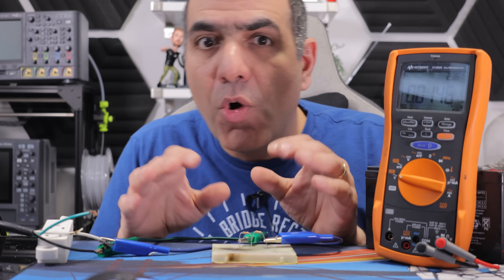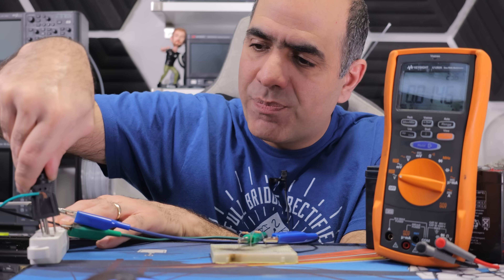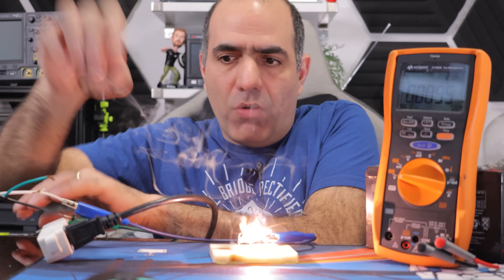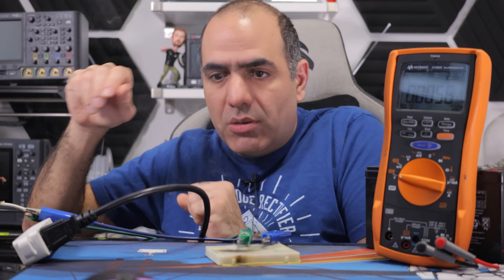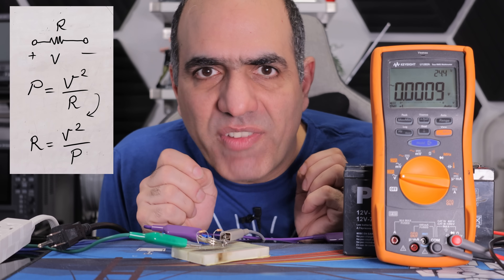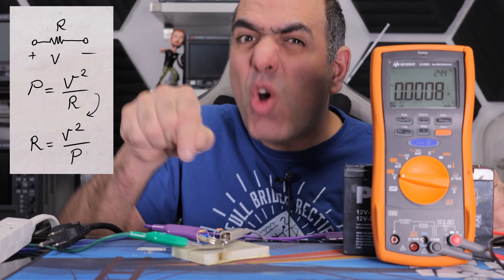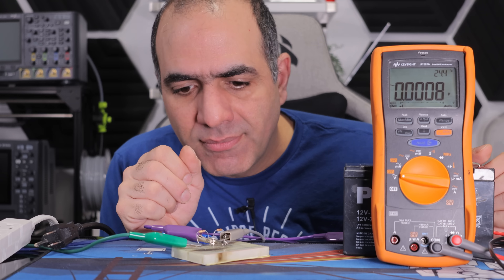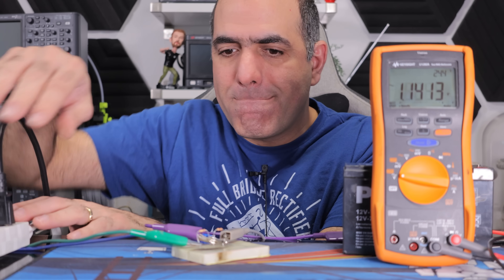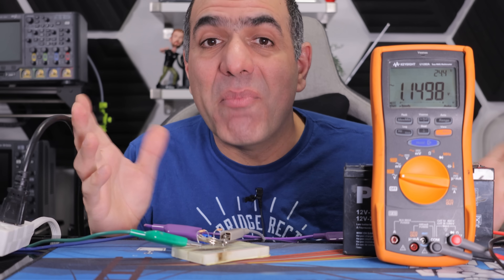Here, I'm lowering the 120 volt AC down to 1.2 volt AC. You must pick resistor values that, for a given voltage, only consume power below their power rating, or they'll burn. These 100k and 1k resistors should be good, though. There you go. Yeah, with these values, they remain cool.